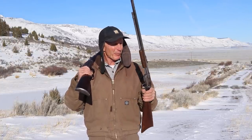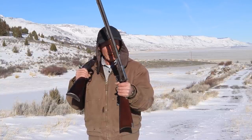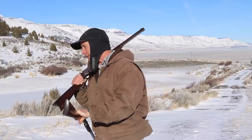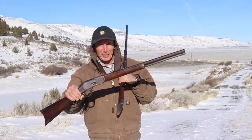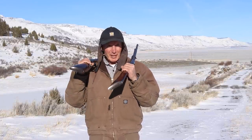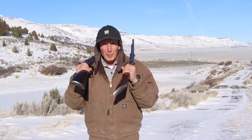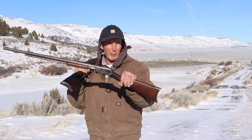One of our viewers who's become a friend brought me this really neat old cowboy-owned 1890 Winchester that he inherited from an old cowboy over at Fort Klamath by the name of Elliot McKeever. He was carrying it in a scabbard on his horse, and it was far enough forward that when his horse turned its head, it split the stock right at the wrist. While I was working on it, he was enjoying shooting this old 1873 Winchester in 38-40 when he started having the hammer follow down. So today we're going to open this up and diagnose hammer follow down, talk about what kind of things could cause that and how to correct them. We'll talk about hammer and sear geometry, and as a bonus I'll show you some of the steps I did to repair and reinforce the wrist on this 1890.